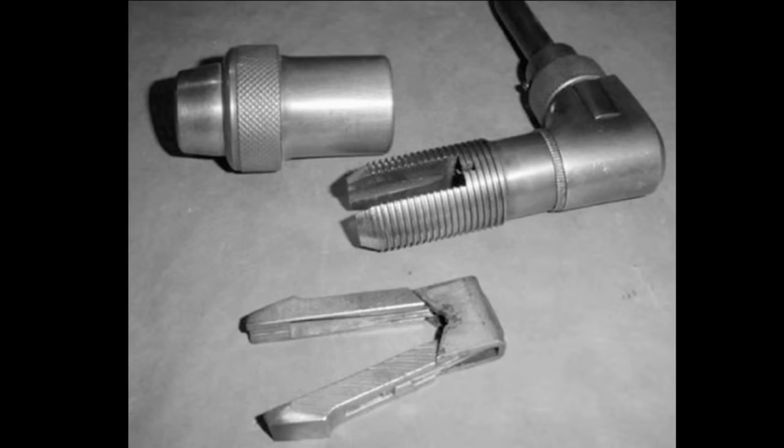There's also a kind of bit brace that has a cylindrical chuck called a universal chuck, and it'll hold even cylindrical things like twist bits or Forstner bits. Grab a universal chuck or get bits with a hex shank, and you can use anything you want in your bit brace. And since bit braces usually cost a couple of bucks, maybe as little as a dollar, if you see one and it's a buck, just buy it. Take it home, figure out the rest of it later.